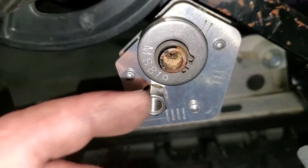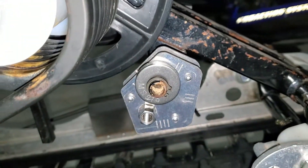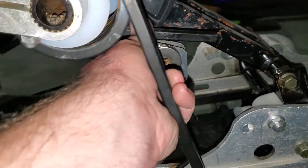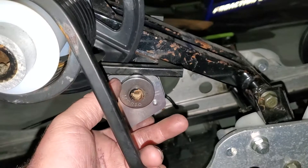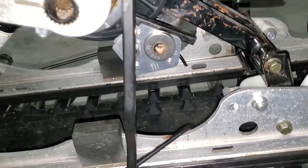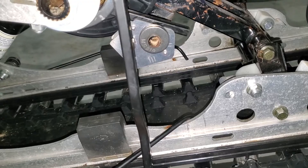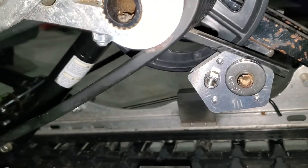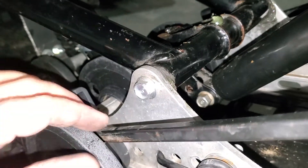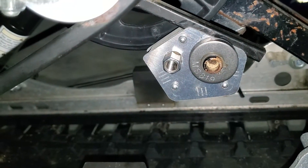The snap ring is back on — I opted to put the crack in the snap ring to the back because that's the least likely to get caught on anything. Then what you'll do is take the spring, bring it all the way back, and set it on position one right there. We'll go ahead and load the torsion spring again — I have to set the camera down for that. Once it's loaded back on, we'll flip the plastic piece back up to cover the top of the spring in the front. We've got our washers on there and we're all set to go.